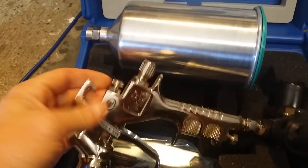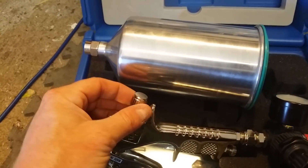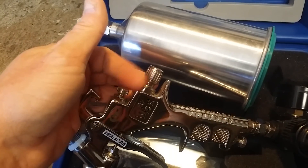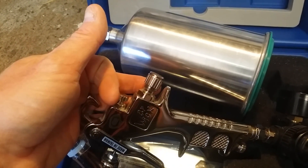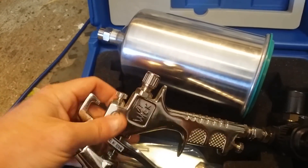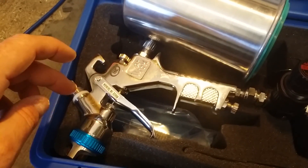A couple of things I don't like about the gun. The needle cap right here feels really thin — like the kind of thin where you feel if you overtightened it, it would crack. Obviously you're not putting that much tension on it, and if you know how to adjust your needle for your trigger it's safe — it's not going to crack. I'd just prefer it to be thicker for overall better quality feel. I've had it apart many times and cleaned the needles and tips every use with no problems. You do want to make sure you don't cross-thread it — they sell replacement pieces, but you're talking about a couple days of downtime.